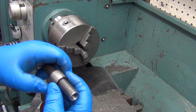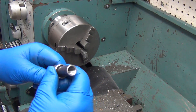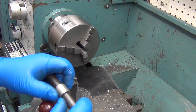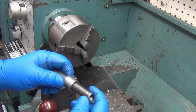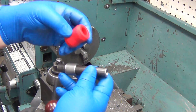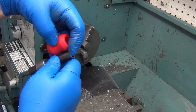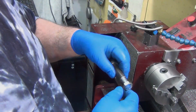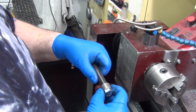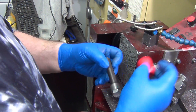I was talking about spot welding a washer on — here's a leftover scrap piece from the outer bearing adapters, that's perfect. I can tack it on if I want, or just for now when I put it in the little lathe, set the depth of the inner piece to where I want it. Basically I'm going to want that to stick out about a sixteenth to an eighth of an inch so that when the bolt tightens down it squishes a little bit. I should make one of those for this end too.